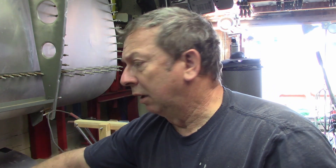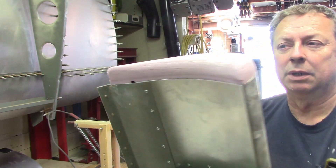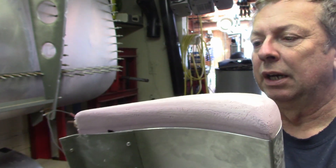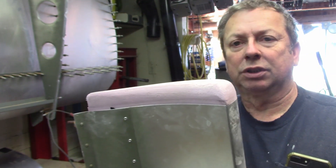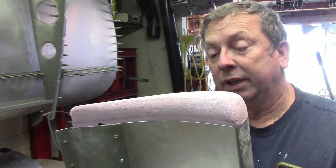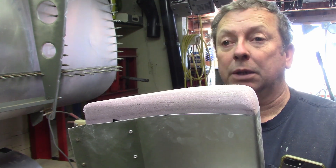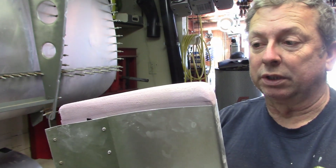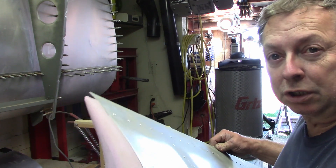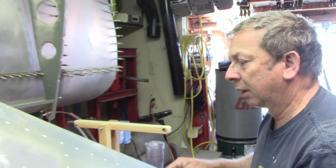Today I'm working on the end caps that go on the slat. This is what I've come up with — this will be radiused down on the back corner. This is the beginning of a plug, and I think I'm going to use this plug. I was only going to do a foam plug for the left and right end, but I need two of each — inboard and outboard on each wing — so I need two rights and two lefts. I'm probably going to build a fiberglass plug; these are ultimately going to be in carbon fiber. I had pulled a couple of fiberglass plugs previously and I've got them here, but I don't like the shape of them, so they're going in the scrap.